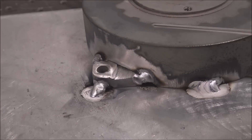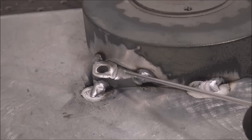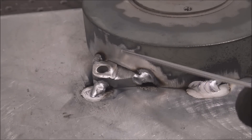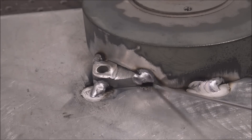There are probably 10 different ways to do it. If you want a full penetration weld, you've got to bevel this out like I've shown in other videos. But on this one I'm just going to gob it up and put all the strength and thickness above the crack. It'll burn into the crack maybe halfway but probably won't go all the way through on most sections.